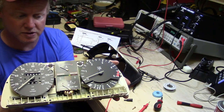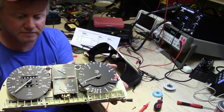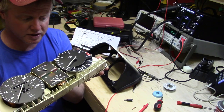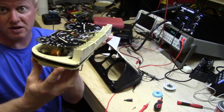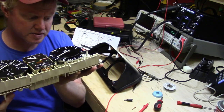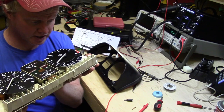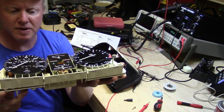A lot of the bulbs are really dirty, and now's a good time to replace them and/or clean the bulbs. The construction is old style construction. The big things to look for are leaky NiCADs, leaky caps, bad connections, and there are a few edge connectors that you need to be mindful of.